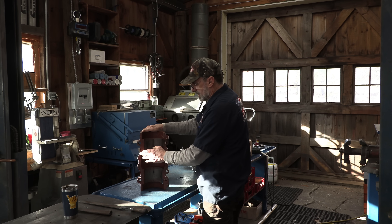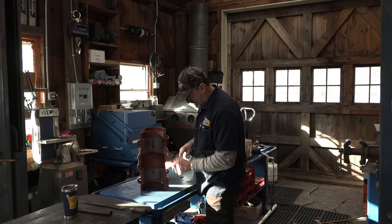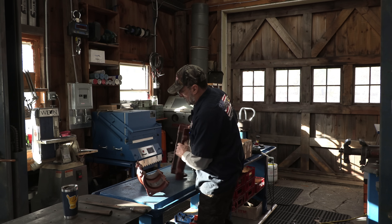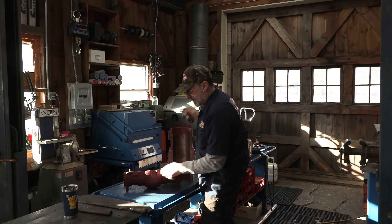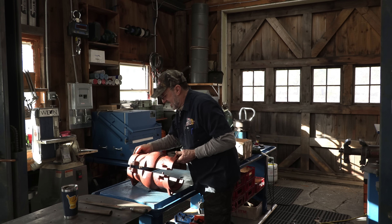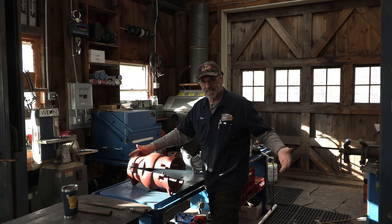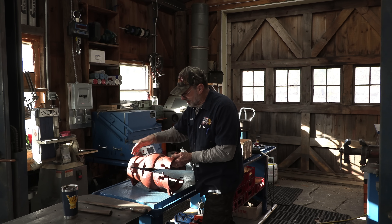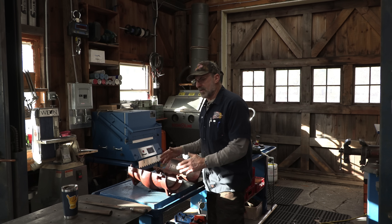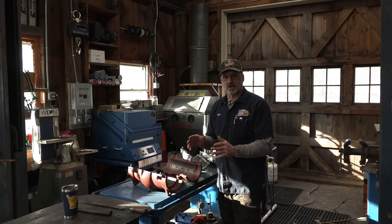There's paint on the surface here — you need to have these mating surfaces metal to metal, so we're going to wire wheel and clean that. The dowels align each half with each other, and we can see this dowel is bent over that direction. You can really see it when you go to put this together — I can put that pin in there, let go of it, and you can see how far off that pin is. We've got to straighten that pin out and clean the face in there, prep these so we can get them together, and then mic the outside of the ball surface to know how round and true they are.